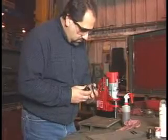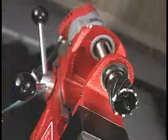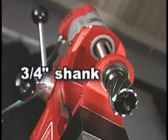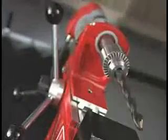We'll show you how to drill a one-inch hole in one-half inch steel. We'll use the best high-speed steel cutters available — Milwaukee Electric Tools. The 4270 accepts standard three-quarter inch shank annular cutters, and with them it can drill a one-and-a-half inch hole two inches deep.